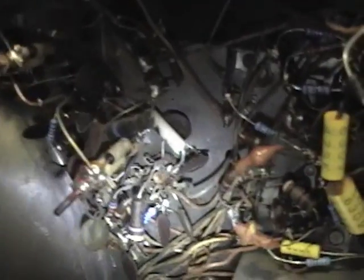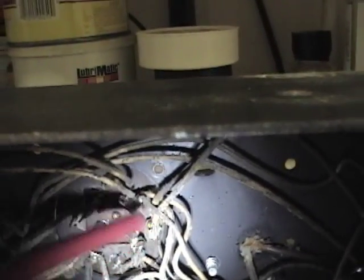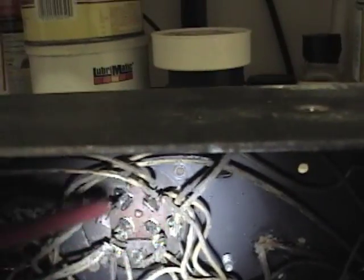So throughout this set there are tie points that are common ground, and the actual metal cans of the capacitors - these two - are grounded to the circuitry. So there are lots of wires going to those lugs that are actually on the metal can; they just find a convenient tie point. There's a wire on this one, this one, several wires here, a wire here, and it's really bad on this one. All those wires are actually just all connected together and they're all just ground points.